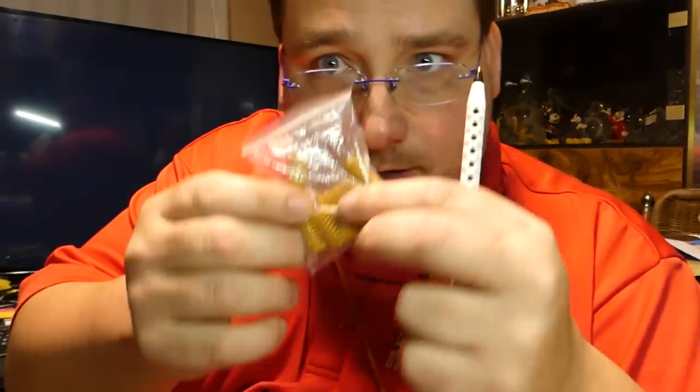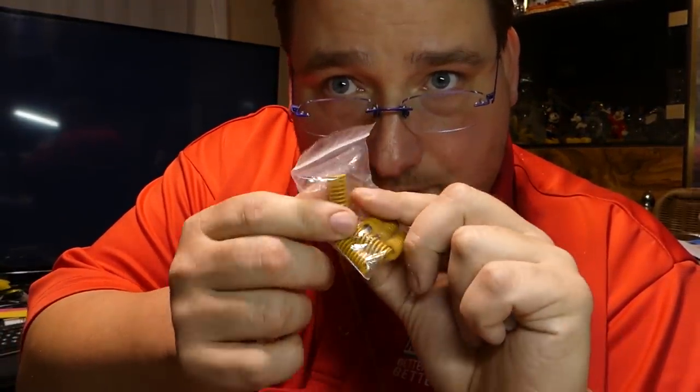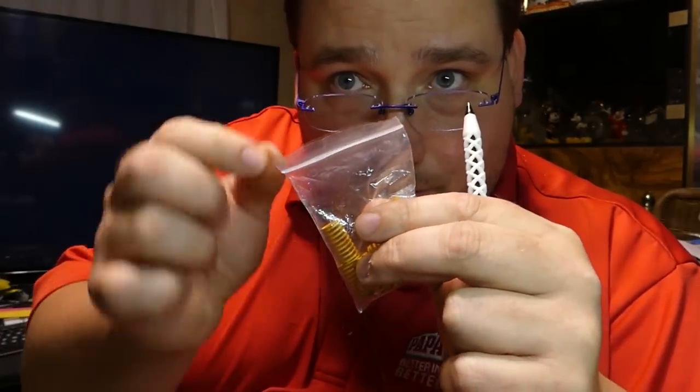So I got light load springs, which are stiffer. These are actually 10 millimeter wide. I have 8 millimeter coming in, which fits perfectly over the bolts. And I have more of these coming in too, because those work great on the Ender 2. I now have them on my Ender 2, and my bed level isn't sloppy anymore.